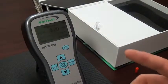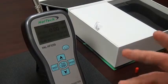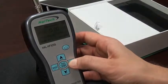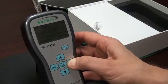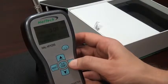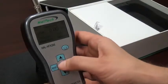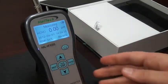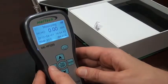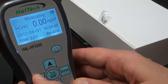In this case, we're sampling from clean air, so we have zero ppm. There's a remote chance we may see 0.01 ppm randomly show up, but at this time it will be zero. In order to store a value while running, we can press the enter button — one data point has been stored in the memory. One last detail on the main screen: we can change the units displayed from ppm to milligrams per cubic meter by pressing the back button, and pressing it again changes back to ppm.